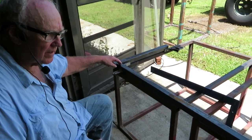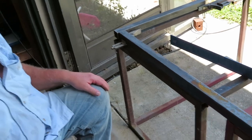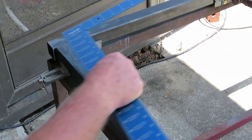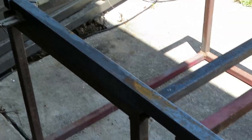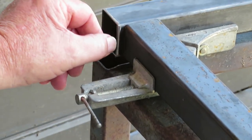These are the three pieces. This is the 50-inch piece that goes across, and these inch-and-a-half pieces are on the sides going up - that's going to be for the sides, placed every 2 feet. I've got these clamps on to square them up - I've used those style of clamps for years. After you clamp them up, make sure it's square. It doesn't have to be perfect, it's just a trailer, but make sure it's fairly square. I over-build everything and over-weld too, so I'm going to weld this seam. The bottom is sticking out about a quarter of an inch so I can put a weld down it, then do the same on the other side.